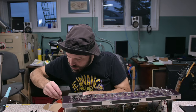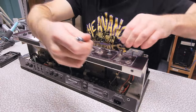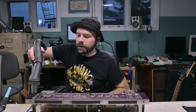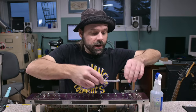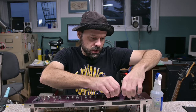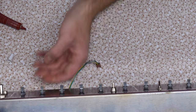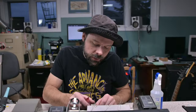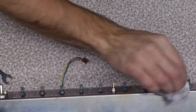We're just going to go through and tighten everything up here. Things like this happen — there's no real way of predicting that. Is this metric? My tool is just a touch too imperial — 10 millimeter. So loose. What I'm going to do is clean all this and then pull all these nuts off and re-tighten them with Loctite, because clearly everything is going to come loose on this guy again. This entire board wants to come out now with the exception of the switches. Let's give it just a little dollop of Loctite. We just want to sop up a little bit of the excess — be careful not to get it in the shaft, that'd be tragic if you couldn't turn your knobs anymore.